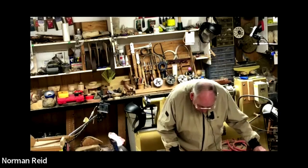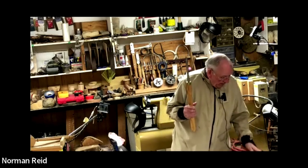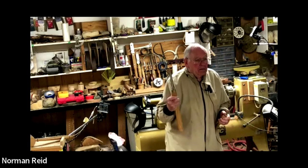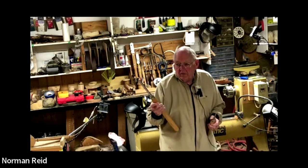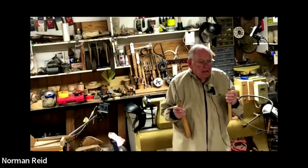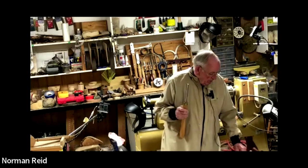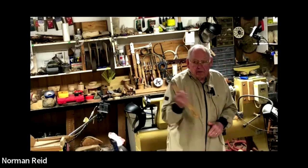Okay. So I use a bowl gouge for lots of stuff, and this is a bowl gouge with the David Ellsworth grind on it. There are a lot of different grinds you can use. I'm not recommending the Ellsworth grind over any other grind if you're used to something else. I also use the 40-40 grind that Stuart Batty has. And I found that with the 40-40 grind, I can get the surface of the wood very, very smooth, almost as good as I can with a skew chisel.